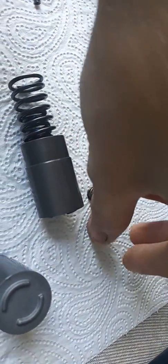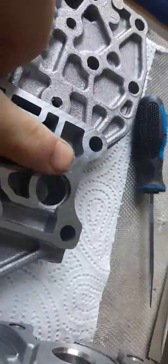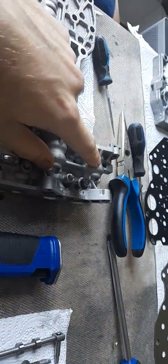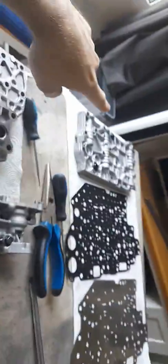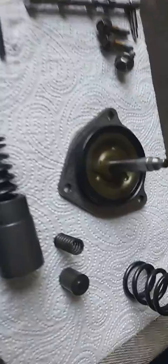Last but not least, this is a tiny accumulator that goes in the valve block. It goes here — so it would go under here — and it's an accumulator for solenoid C, particularly for the three-to-four shift. There was a surprising amount of dirt in these accumulators. The worst part of the gearbox — there was a lot of dirt around here especially — and when I cleaned it all up with carb cleaner it definitely showed.